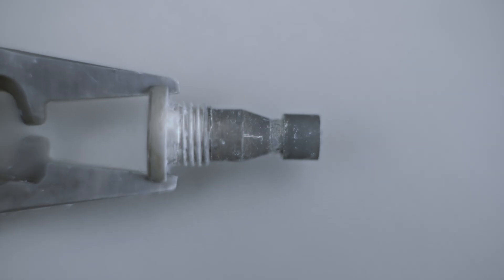Next up is the radium post out of the top of that Pyrotronics smoke detector, which has a radium foil wrapped around the top of the post. As I bring the zinc sulfide screen closer, you can see this spray pattern of all the alpha radiation coming off that post. It looks like noise in that blue, and what it actually is are alpha particles interacting with that zinc sulfide screen, producing scintillations — little bursts of light.